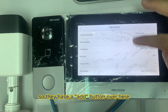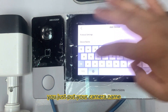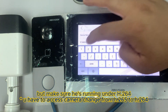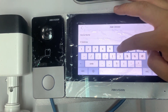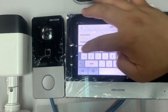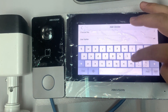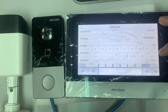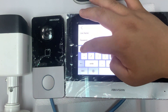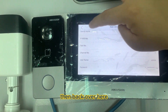They have an adapter here — you just key in your camera name and your camera IP address. Make sure it's running under H.264. Then enter the username 'admin' and also the password. Once that's done, it's ready.